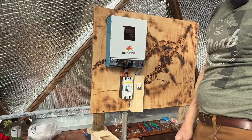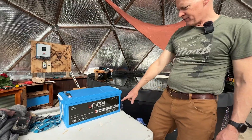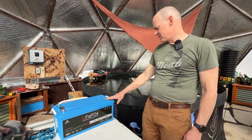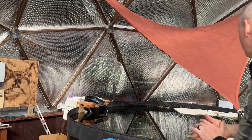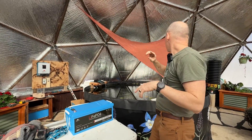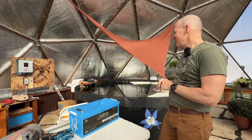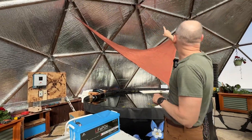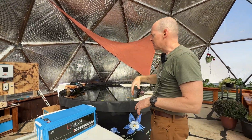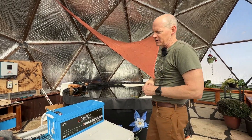So 24 volts, 100 amp hour batteries — we'll have two of these, so 200 amp hours total. With a 3,000-watt inverter, we should be able to power our GAP fan, lights, and the pond pump, maybe even a circulation fan. The GAP fan doesn't use much power at all — it's in the neighborhood of 50 to 60 watts. We're going to have lights almost in a circle up there, and LEDs don't use much power. We're not going to have them on all night — we come in, hang out for a couple hours, then turn them off.